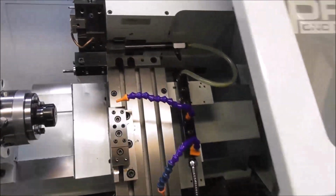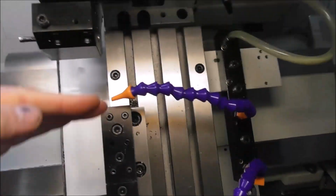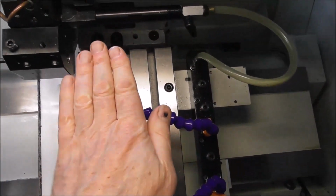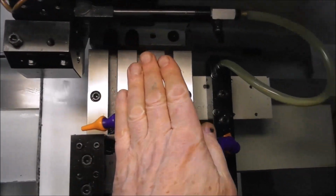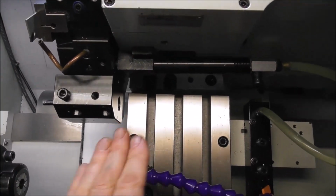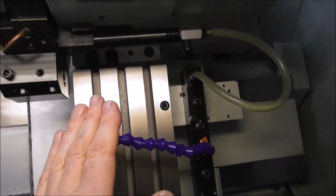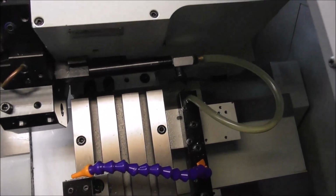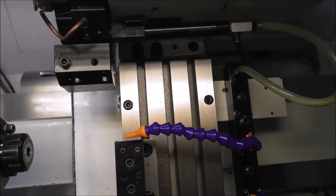And we have that problem with the Slant Pro. The length of engagement this way relative to the width of engagement this way is very poor, and so you'll tend to get a racking of the whole carriage sliding on the bed every time you change direction, and that's really a bad feature because that'll cause wear in this high pressure area down there. So it's even more important to keep it clean and lubricated so that this Achilles heel, exacerbated by the ratio of the slideway, is minimized as much as possible.